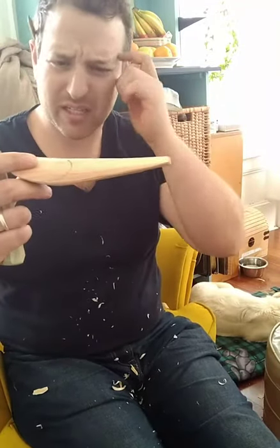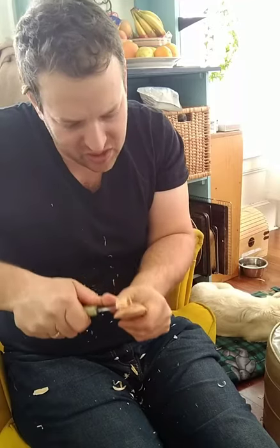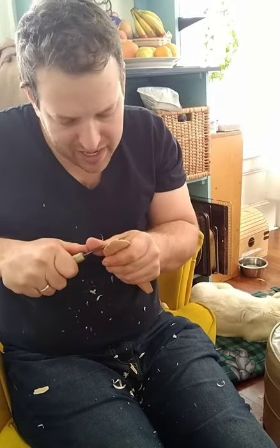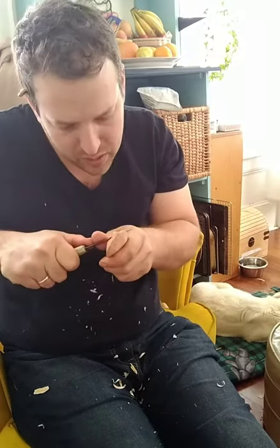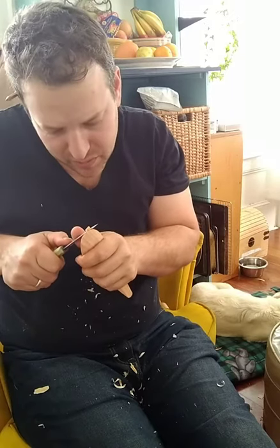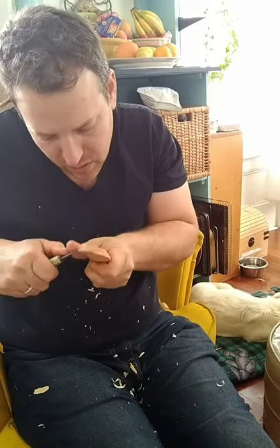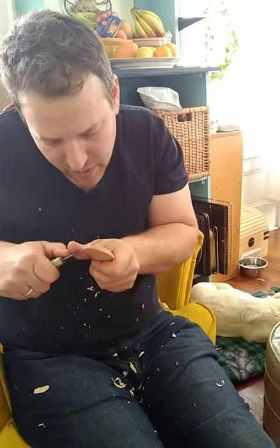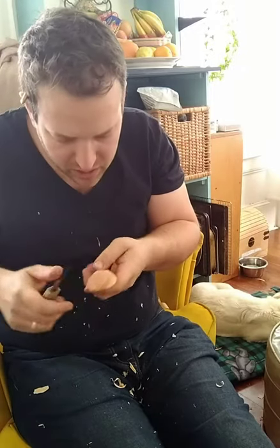adjust the bottom, and adjusting the bottom really has more to do with your innate sense of how deep a spoon needs to be. So if you have another eating spoon, I would suggest putting it side by side. And you'll probably be surprised at how shallow an eating spoon truly is. I think we all have a tendency to make them deeper. The thing about a pocket spoon is that it's missing a lot of the cues because that neck makes it confusing. So it's all the cues of how the proportions of things are missing because that neck is getting in the way of how we tend to calibrate something. And I've found that the tendency is to make something that is overly large.